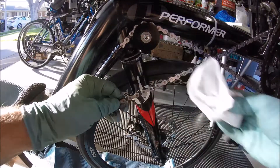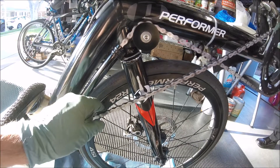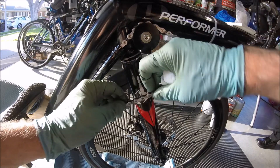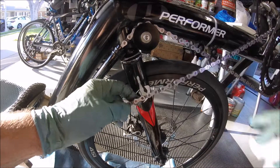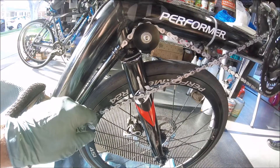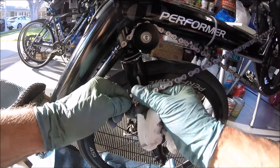We've got three of these, so we go back one, two and a quarter turns on the crank. Here's our next one. We do the same check on it — make sure that our fingernail catches the riveted pin there. And the last one is one, two and a quarter turns — there it is. Same thing. Yeah, all looks good.